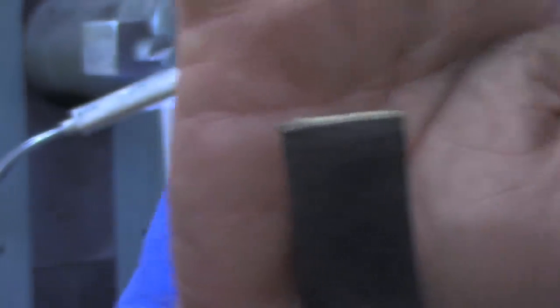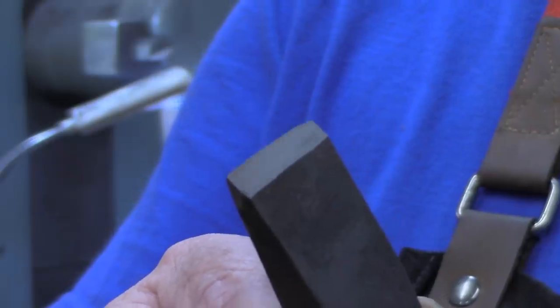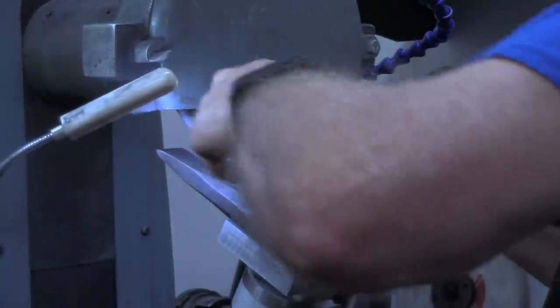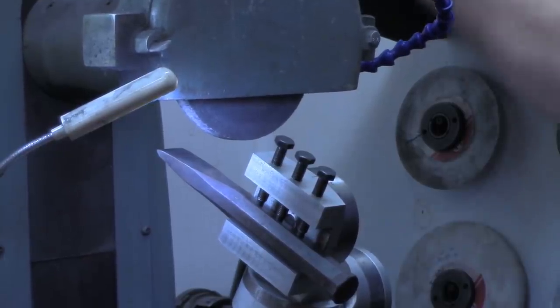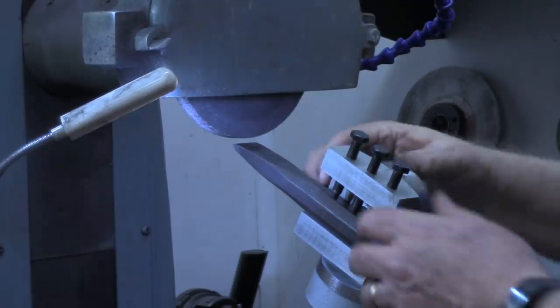Here is the age-old bench grinder surface, and here is what we just put on with the surface grinder. Now that I've got it out, I'm looking and I'm seeing right here on this end that I've not quite gone deep enough. But I think once I turn it over and get this side it'll take that little nick out right there on the end. The fact that I didn't necessarily get this in at the same depth means I'll need to come back up, find my zero again, and then come down to 24 and a half.